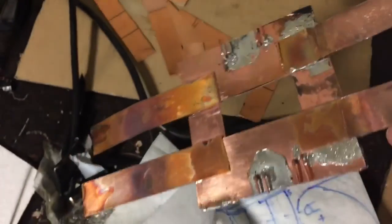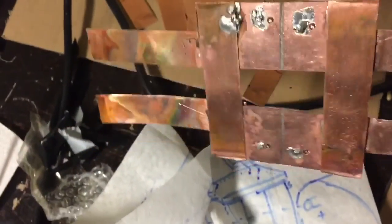The whole purpose of making a bridge in this way is to reduce parasitic inductance that could mess up the operation of your Tesla coil in a full bridge or half bridge setup. This video is dealing with the full bridge.